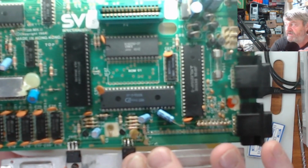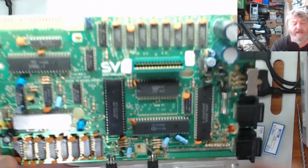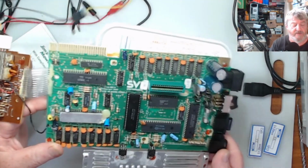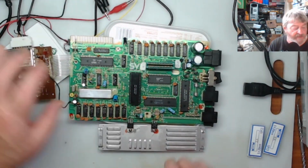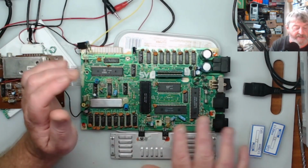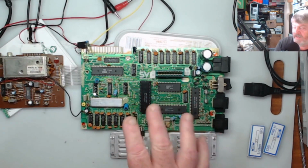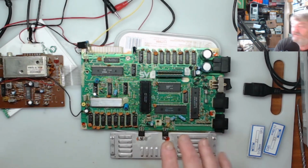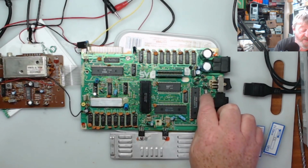that's the 5 volt, and it looks like quite a mess down across the pins. It's more so I can see it quite badly. But the 12 volt that I replaced, I put new heat compound on it, and it's a lot nicer. And this one, it's working 5 volts okay. So whether someone's had these in and out, I don't know. But anyway, the fuse was over here, of course.